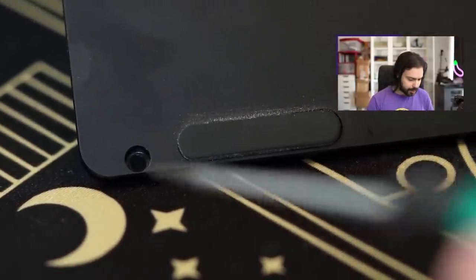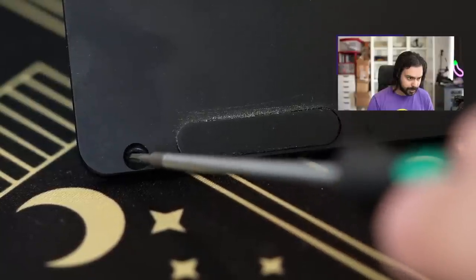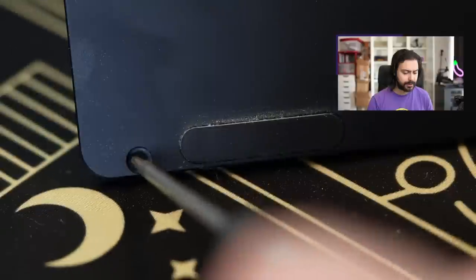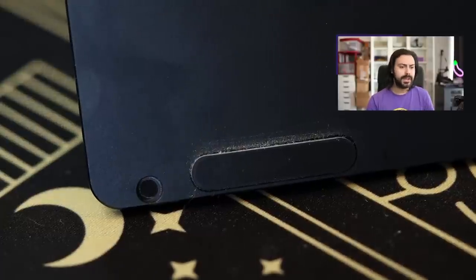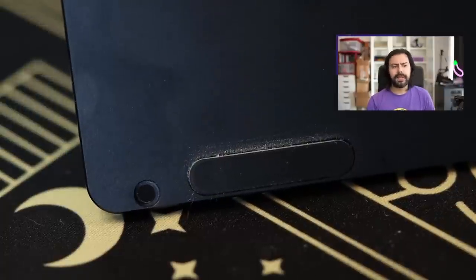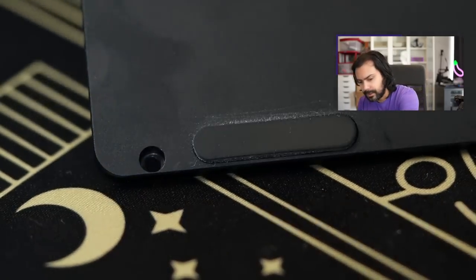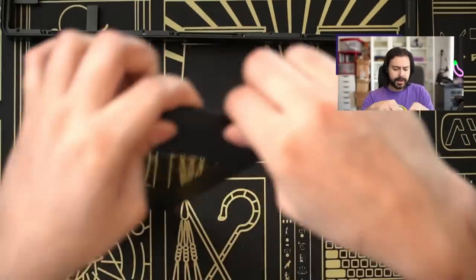All right, so when the screw goes in, it actually makes contact with this part of the bottom case, pushing the bottom case into the top case. The alternative method would be to just do a straight tap, all the way through, where the screw would not necessarily interfere with this part, but it's fine. More or less, this is a relatively standard way of dealing with it. Normally, these little ledges are just further in, but this is a really thin piece, so it's easy to notice on this. So yeah, that's the bottom.